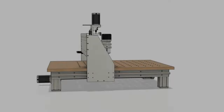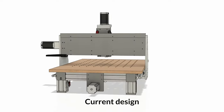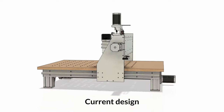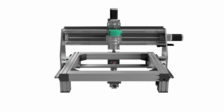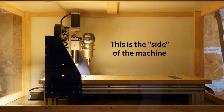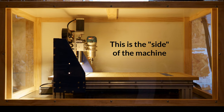There's also the issue of cost, so it all comes down to how much you want to spend and what type of things you want to make. With this design, I was trying to cover all my bases and keep the machine semi-portable. So assuming I built another similar-sized machine with the same purpose — first, I think it might be better to have the x-axis be longer than the y-axis. Basically, I'd swap the lengths of the x and y-axis linear rails and screws. It's a bit awkward that the machine is longer than it is wide because I'm always looking at it from the side.